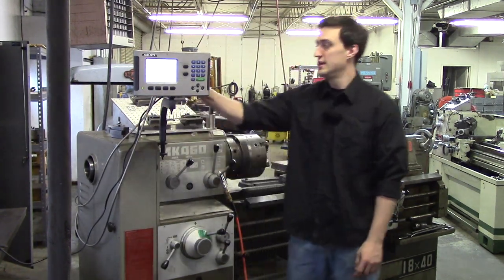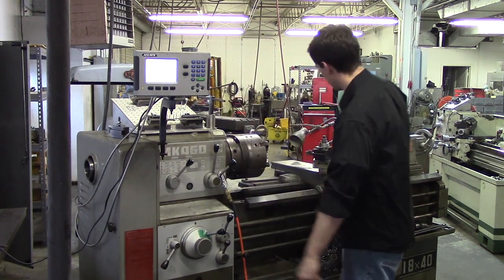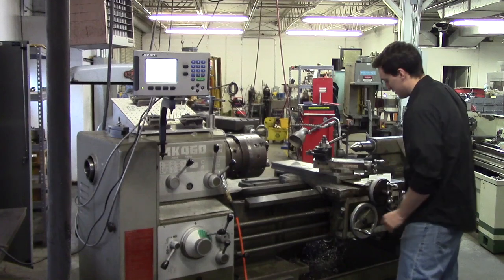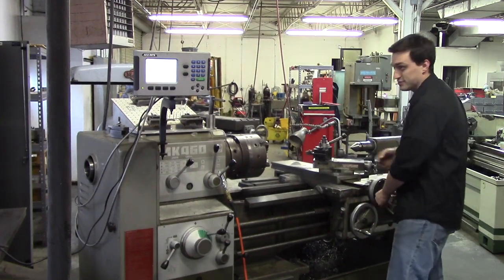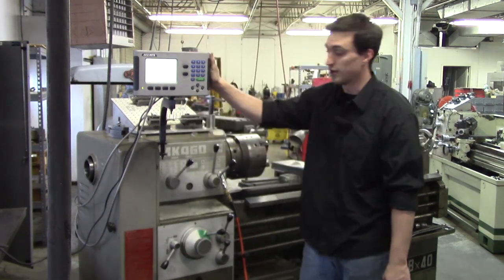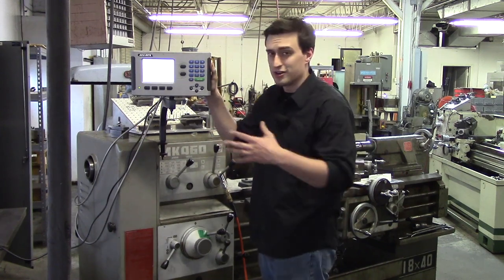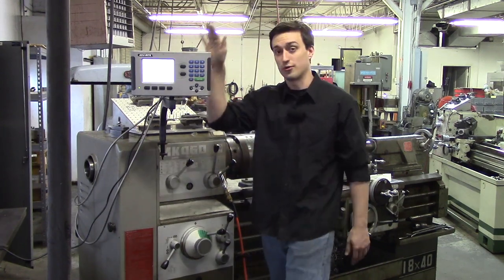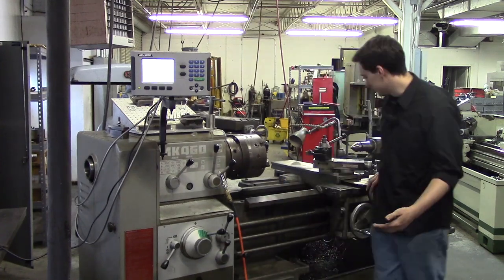You can see we have wired in a DRO — a Digital Readout. I would highly suggest getting one, especially if you use your lathe every day. It is very useful instead of setting up a travel indicator or relying on your dials. It can measure within a few tenths, so it may cost a little money upfront but in the long run it'll save you money.